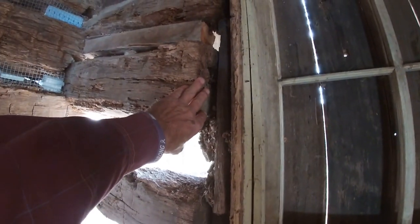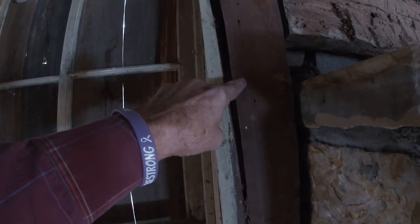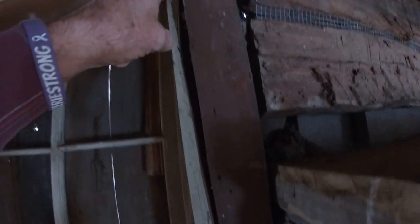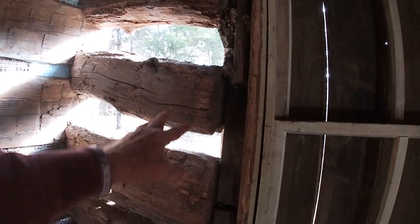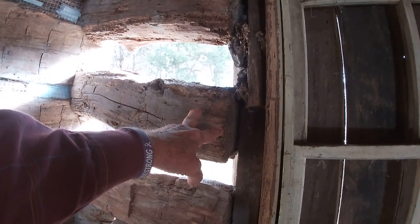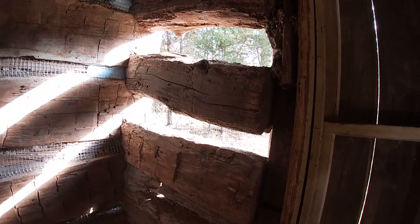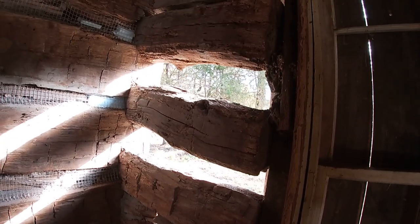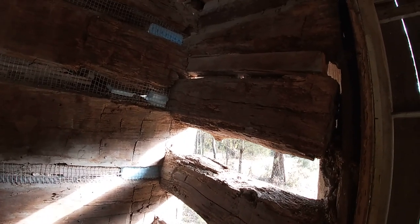I'll put a laminated face on the outside and fill from here over. I've got a treated 4x4 to put here, going up to that log right there that goes all the way across, and it'll go down to the footing. I'll be able to hook to that with the outside faces all the way down. These logs here — there's nothing holding them up except the notch in the corner. I've got to shim them up and raise them some, but I can't raise them a whole lot because the notch itself has them locked.